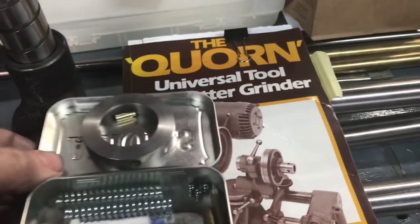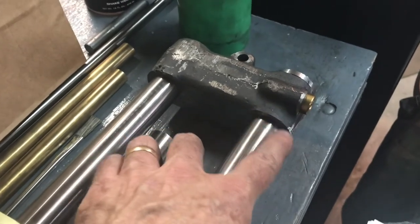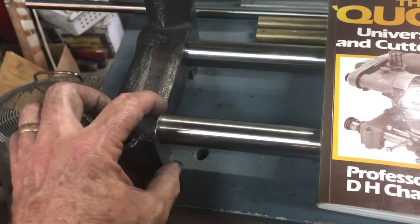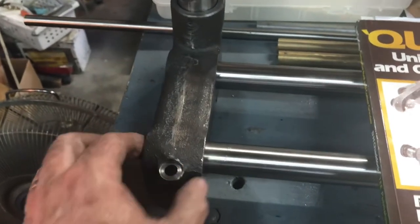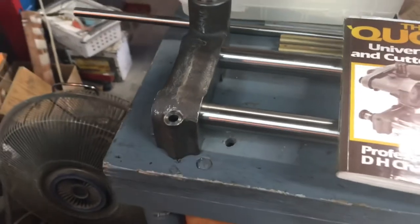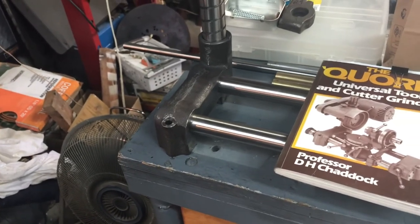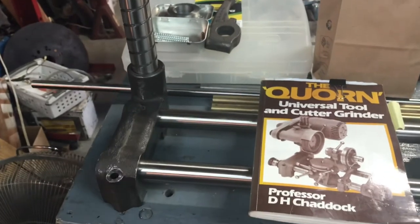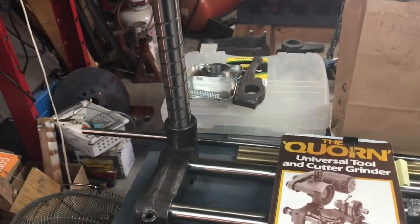The next thing I plan on making is the dust covers — three holes on the inside of the front bar. The book calls for an inch and three quarter circle, but that would stick out, so I'm going to use inch-and-a-half steel, an eighth inch thick, with three holes, and I'll make a recess on the back side to put some felt in. I've seen a lot of these builds that don't have felt seals at all, so something will be better than nothing. When I use the machine, I plan to cover the bed bars with old cotton t-shirts or newspaper — something I can just throw away when I'm done.